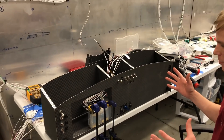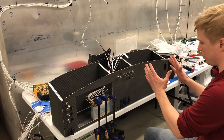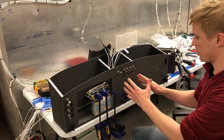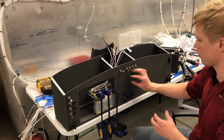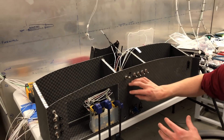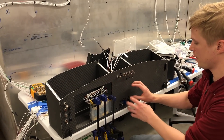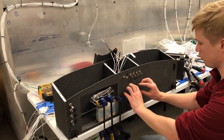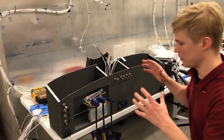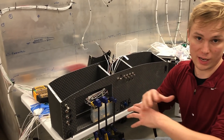This will establish our first flight setup, so we will not have an additional display except for the iPad tablet driven off of our iLevel 3 as a hardwired backup. We won't have some center elements like the autopilot control module — those holes will be deprecated from a previous setup. In the future that space will be taken up by the autopilot module. We'll still have autopilot through the G3X, just not the Garmin control box, and we won't be putting in a GTN 650 module below — that will all come in due time once we move toward an IFR setup after flight testing. In the meantime I'll be rerouting wiring to the new components before installing everything else in the panel.